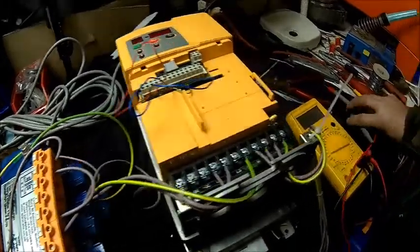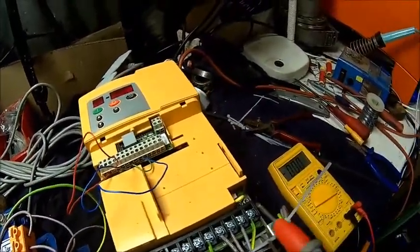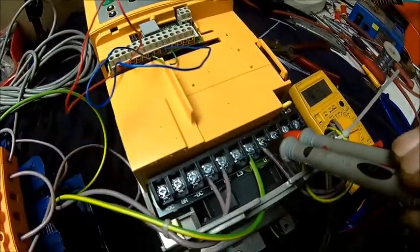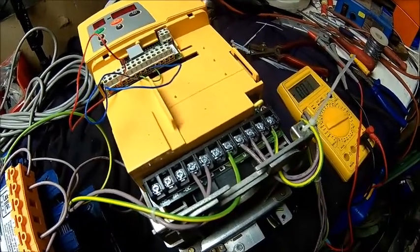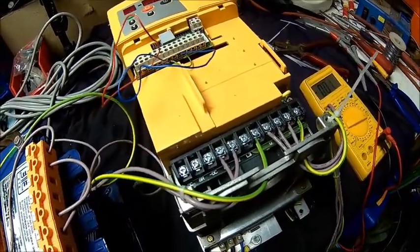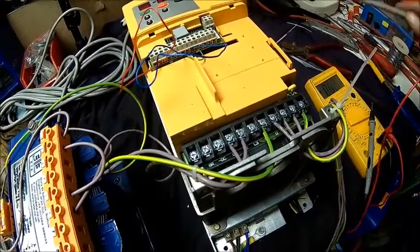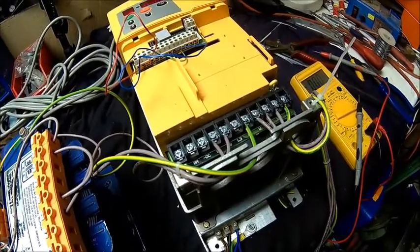The output is constantly live. The meter will read garbage because of the PWM signal — it reads about 470 but that's not true. There are high transients on it with no load. I may fit some resistors of just a few kilohms to make sure it doesn't spark anything or cause damage from those high transients.